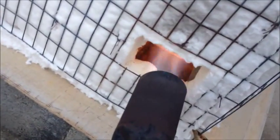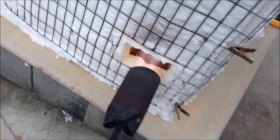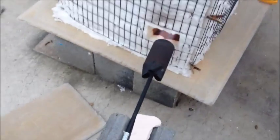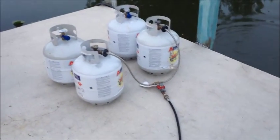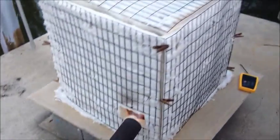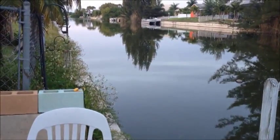I'm one hour into the firing now, up to about 910 degrees. I've got a pretty good flame going in and it seems to be set about right. I'm going to leave it where it is and hopefully get over the 1060 degree mark, maybe up to about 1100, before my propane runs out — I don't want to have to go through the quartz inversion temperature twice. Beautiful evening, no alligators out tonight, just a couple of turtles swimming around. This is alligator mating season and usually we see some this time of evening, but nothing showing up so far.